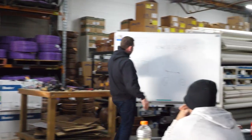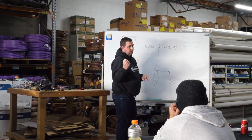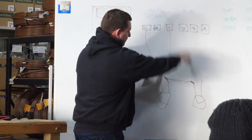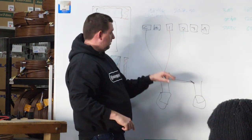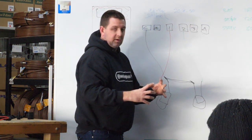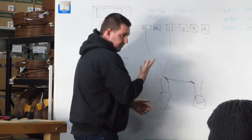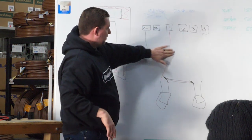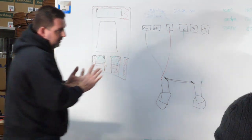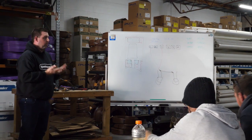If you've done all that properly, your controller turns on valve one. What it's doing is taking your 240 volt current, transforming it down to 24 volt alternating current, and sending an alternating current down the common and whatever valve's being asked to turn on. As soon as that gets broken - because someone hits it with a shovel or the electricity goes off at the house - that valve will close. If the power goes off mid irrigation cycle, your system will turn off because the solenoid valve needs that continuous pulse of electricity to hold the coil up.